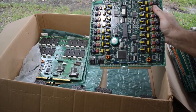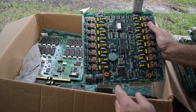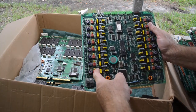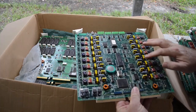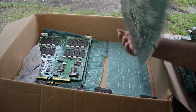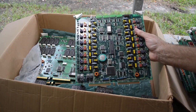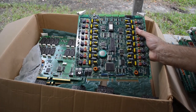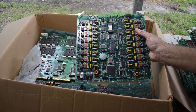Here's another one — he's got a lot of these type boards. These would have interfaced telephone lines. Each of these, I think, would have interfaced a telephone line, and it looks like 16 lines on each of these cards that it could interface. MLCCs on the back, Z80 on the front, supercapacitor, MOSFETs again, and all the usual stuff.